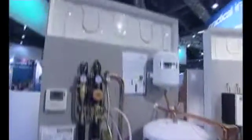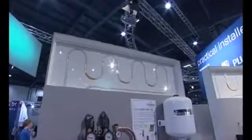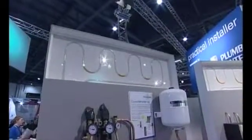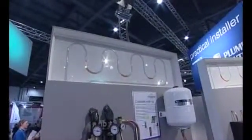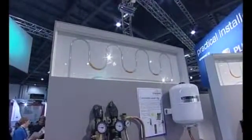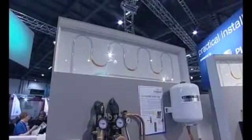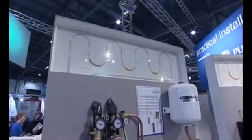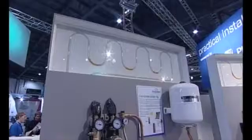The pump is designed to circulate 27 litres a minute, which should be sufficient to treat most systems. It's got a five-metre head, so pretty much any domestic installation you'll come across it will cope with. What we're going to do now is dose the system with Solar S1 fluid.